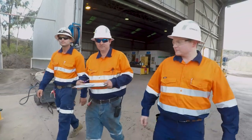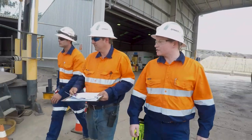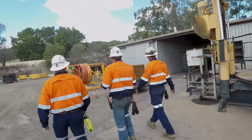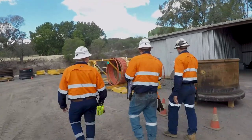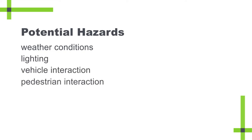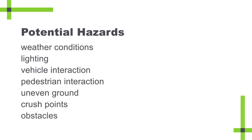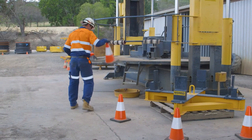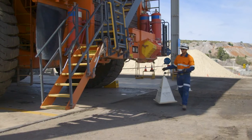This can be done with your team during a Pre-Start Job Hazard Analysis, or JHA. As a group, identify any hazards in the work area that could affect tyre handler operation. Things like weather conditions, adequate lighting, other vehicle interaction, pedestrian interaction, the effect of gravity on uneven ground, crush points in confined areas and any obstacles including overhead obstructions. Any area where a hazard is identified but can't be effectively controlled or removed means the area is unsuitable for tyre fitting work.